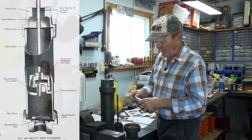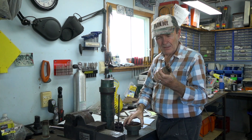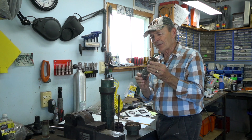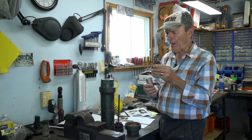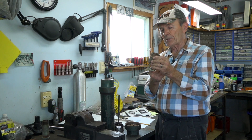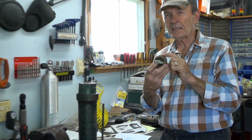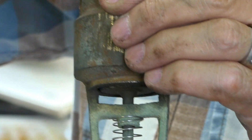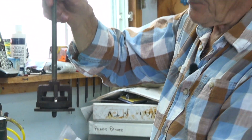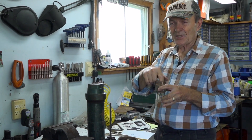This particular pump has an additional feature at the bottom — a screen. It sits at the very bottom of the long sucker pipe, and as mentioned, the screen keeps frogs, leaves, and large debris from getting sucked up into the pump and damaging it. This device also has a spring-loaded valve. When the piston is going down, this seals so water isn't pushed out the bottom. When the pump wants to suck water up, the spring-loaded valve opens and draws more water in.